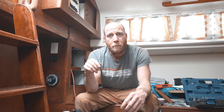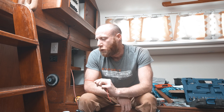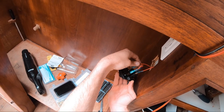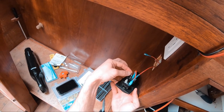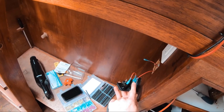Remember, bilge pumps should be an unswitched load — meaning even when your battery switch is off, power can still run to the bilge pump. If you leave your boat and turn your power switch to off and something fails — a seacock fails — you want your bilge pump to still come on. The main battery positive comes into this post so current flows through the fuse before it even gets to the switch. This is our manual positive, this is where we'll attach our float switch positive, and this is the negative going back to a negative bus.